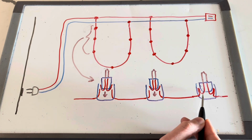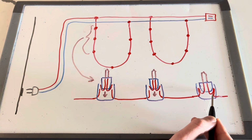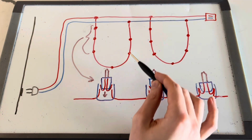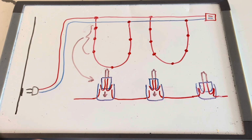And you can see here in this third diagram an example of where if you push the bulb down into the socket, there's a mechanical connection that actually takes place between the wires and this piece of metal in the bulb. So after the 50 bulb replacement did not work, I needed to work my way through this strand of light bulbs to determine where I was actually losing power, meaning power was coming in on one side of the bulb and then it was not leaving the other side of the bulb.